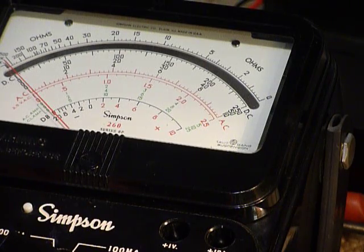That shows a difference in resistance, though not much of one because there is a choke on this circuit board with a low resistance. If I disconnected the choke — which I can do pretty easily — you'd see quite a considerable difference.